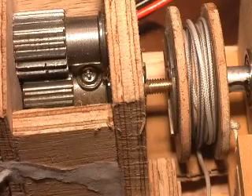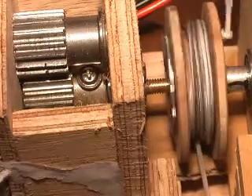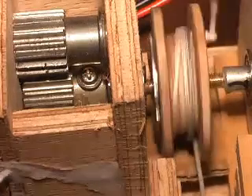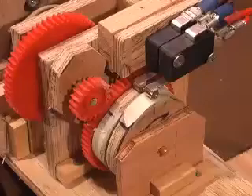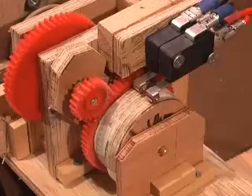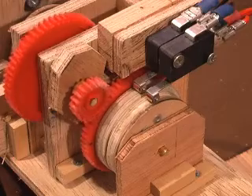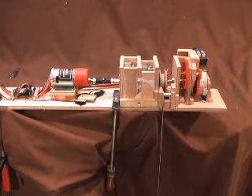The drum has a similar pair of brass strips on a washer which is affixed to the drum. It will move along, hit the dogs, and now it's driving. Two pairs of plastic gears are used again to have the drum and cam axes in line. They have an 8-to-1 ratio so the cams do not rotate a full turn and the drum rotates 7 times.